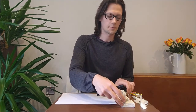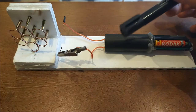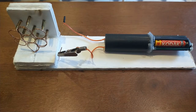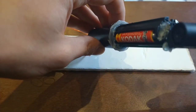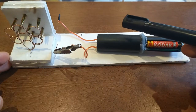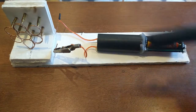So how did I manage to build a model to demonstrate this concept? Here it is. All of the parts are really quite easy to obtain and find, except for one in the middle, and I'll talk you through it right to left. At this end I've got the battery carrier from one of those cheap 9-LED flashlights you can find in places like Poundland. I've taken the battery carrier and the push button switch out of there. The wire is just twisted together, and there's a bit of hot glue holding this assembly together. This slightly more exotic component is a little high voltage step-up module.